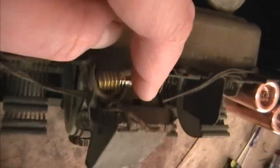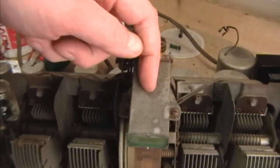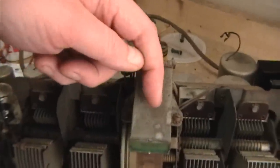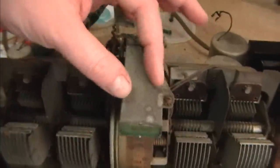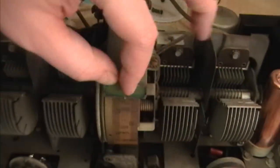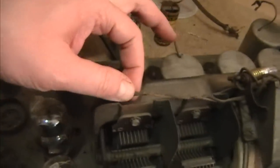Light shines through that hole and illuminates the green panel up front. Inside here there's a coil of wire, a horseshoe magnet, and a little vane made out of aluminum. That meter movement makes it twist or move back and forth — open and close — which makes a shadow on the panel that opens and closes as you tune in stations. That's what these two wires are for — that meter movement.